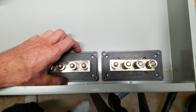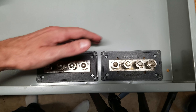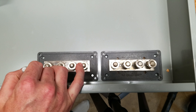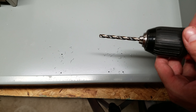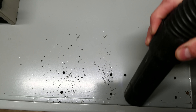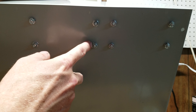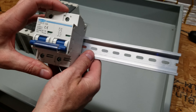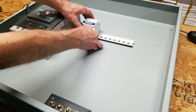The next items I need to mount are the two bus bars I'm going to be using to connect all the cables to the output of the shunt trip breaker. I have them positioned in the lower right corner of the enclosure. Like before I'm just going to mark off where the holes are and drill my pilot holes. Once the pilot holes are drilled I switch to a larger drill bit to accommodate the full size of the screw. All eight screws are in holding down the two bus bars, with one flat washer, one lock washer, and one nut on the bottom.